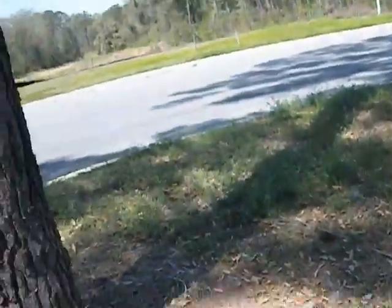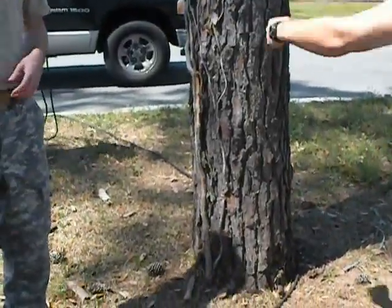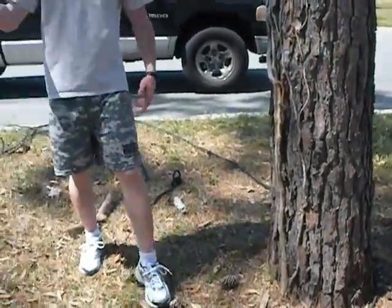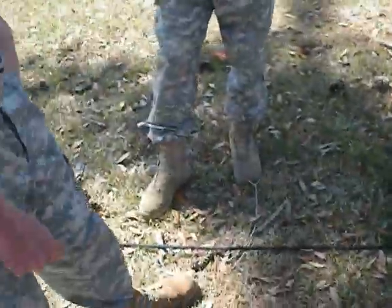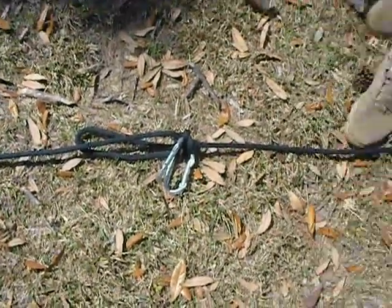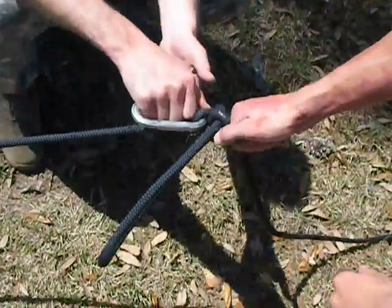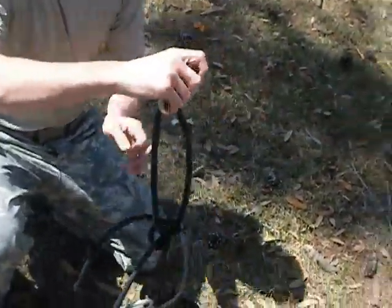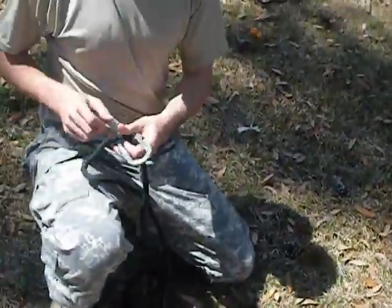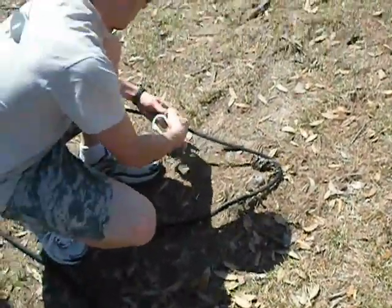When you say breakdown, he breaks down that knot — both pull the quick release at the same time. To break down, just grab that big loop and pull through. The last step: pull the wireman's knot apart — that takes two guys. One grabs that D-clip, you grab this D-clip, pull, he lets go, you pull through and unclip the D-clips. You'll have two more D-clips down on the far end — unclip those on the far side on your own. Those are the far-side clips.